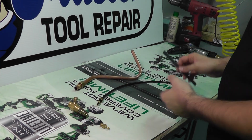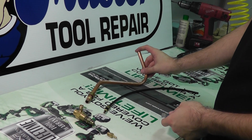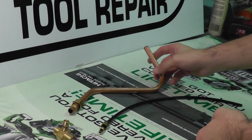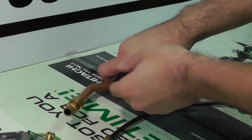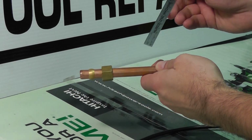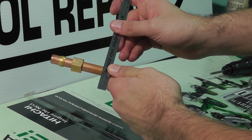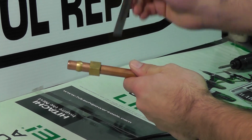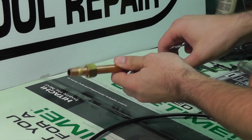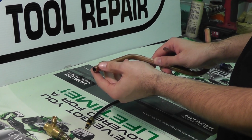It's actually pretty simple. The discharge tube or transfer tube right here runs from the pump head down to your tank or your supply line. To measure the correct size for the tube, we're going to measure the outside diameter of the tube. That's always what you want to do, measure the outside diameter. Here on the ruler we have exactly a 1/2 inch OD, or outside diameter, hence 1/2 inch tube. On the tube we have a 1/2 inch compression nut and 1/2 inch compression sleeve.